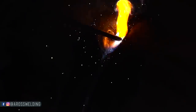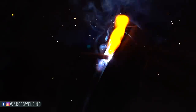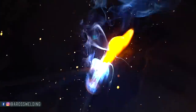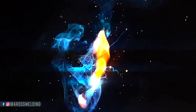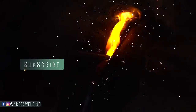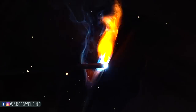My biggest piece of advice for hot passing a piece of pipe is to turn it down and slow down. Just because it's called a hot pass does not mean it needs to be blistering hot. The way you learn is by slowing down — it takes time to learn this puddle and react to it.